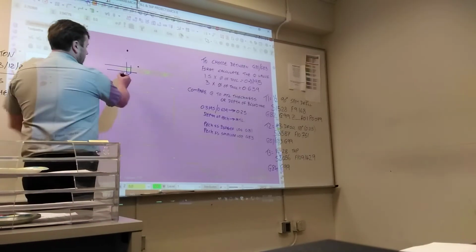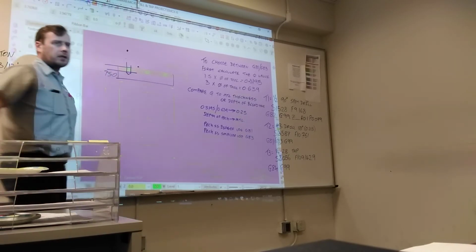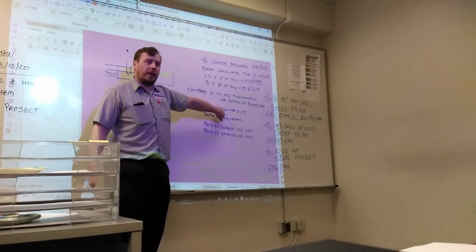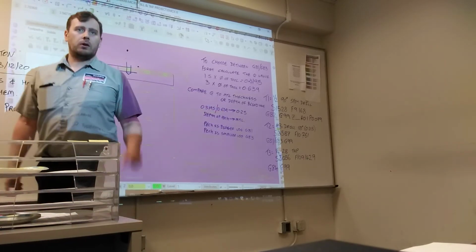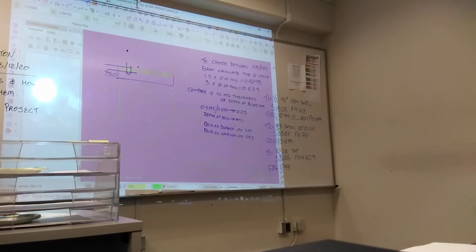So if I change the material thickness, now we have 750 thousandths. Do you want to take that in one cut? No, the biggest cut we can take is 639. So you can't use the G81. So it all depends on the material thickness against the peck size.